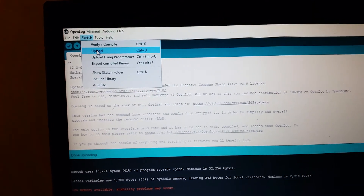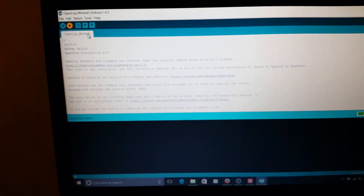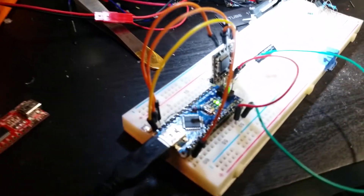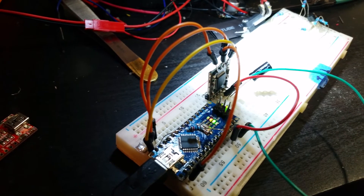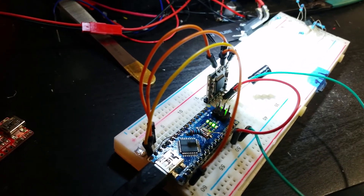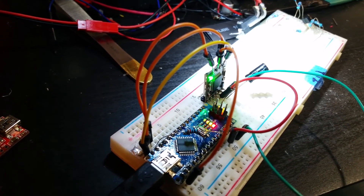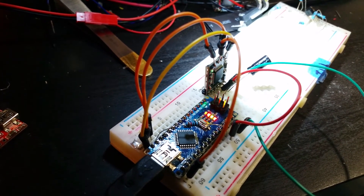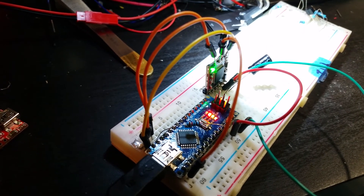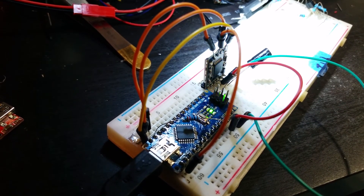There is a way to program the firmware via this same method, but I'm not going to risk it — I'm going to hook it up to my FTDI adapter. Now we plug it in. The bootloader is written to the chip and it's actually communicating. This is an FTDI 232 with a jumper for 3.3V and 5V — always use 5V on this stuff. Now let's write the firmware.